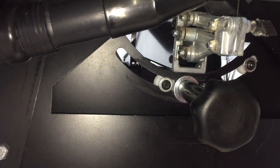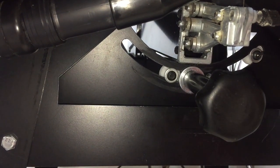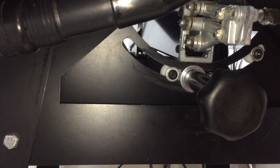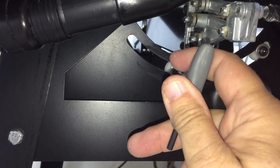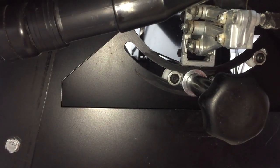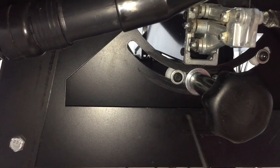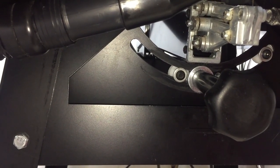It just takes a four-millimeter Allen wrench to loosen and reposition the stops wherever you want them. For example, if I'm cutting dovetails on the scroll saw I can set one stop at seven degrees and the other at 90, and move back and forth between them easily. I keep a little Allen wrench down here and for the most part I leave one stop at zero degrees and always tilt the table in one direction. If you need to move or remove the stops completely, that's no problem.